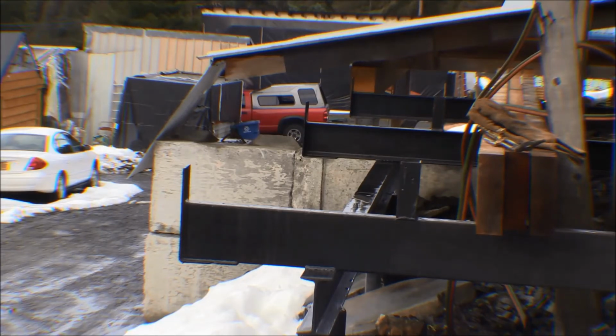I didn't try to get this in between sprinkles here. I've been working on this porch project off and on for the last year. I got new extensions for it. We decided to extend it out to 10 feet instead of 8 feet, and the reason is the retaining wall I put down there for the basement goes out 12 feet. If I run 8 feet and a 2-foot overhang, the splash off that porch would land on the retaining wall and splash down into the basement entryway. So I decided to make it a 10-foot porch with a 2-foot overhang. That'll make my splash zone just past the edge of that retaining wall.